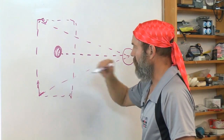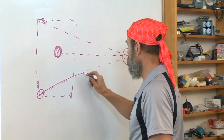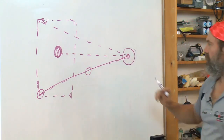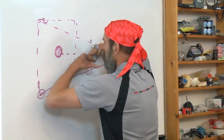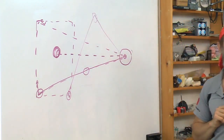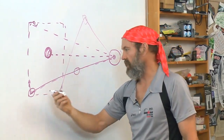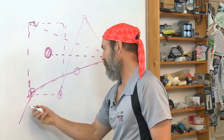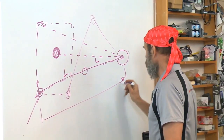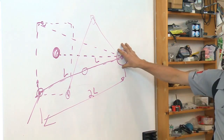Right away I can start thinking: what if this is the end and here are the links like that? Can this design now move to reach that point? It can. With a drawing, I can start to explore that. When I start thinking about the forces from drilling coming down — force F applied here — I know this lever arm, this total length L, this is now 2L, and I can start to think in terms of the forces that this joint will have to resist.